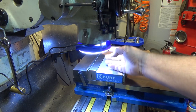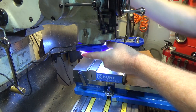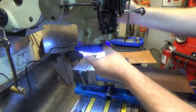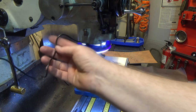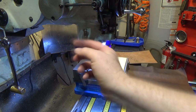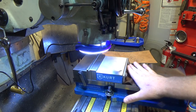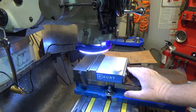This is adjustable up and down — I've got it all the way up right now and I can go down as well. I just need to make sure the quill stays centered — the flat on the rod lines it up more or less correctly. So here's the light in place. I need to do something with the wires — I think I'm going to come up with a magnetic solution. Keep them out of the way so that oil won't be a problem for the magnets holding, and I don't have to glue anything on the side or drill holes in the casting. Magnets, I think, is the way to go. I'll let you know when I come up with that solution.